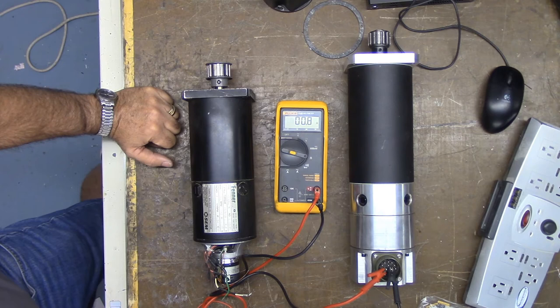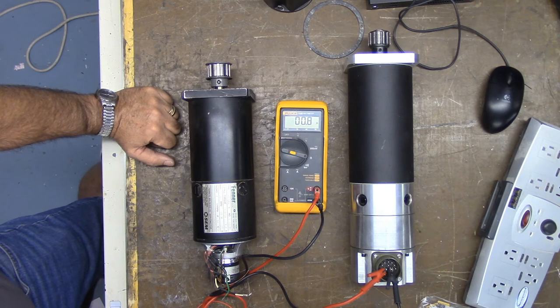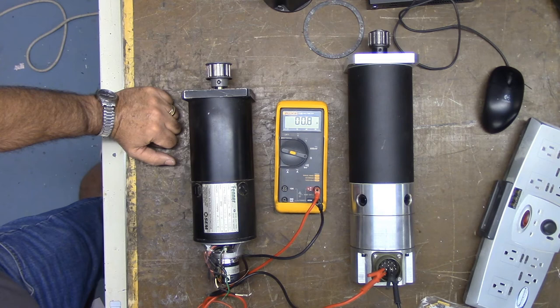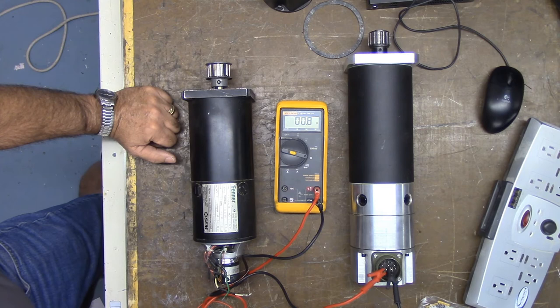and are independent of shaft position. If a motor winding is shorted, the measured resistance will typically be lower than that of a good motor. Here, a comparison of similar motors can be very useful in diagnosing a problem. For motors with a damaged commutator or an open winding, there will be a lack of continuity. In the case of a damaged commutator or open winding on a DC brush servo, continuity will be lost when the brush passes over those areas. For an AC brushless servo with an open winding, there will be no continuity at any position.